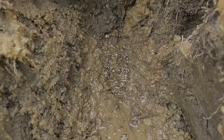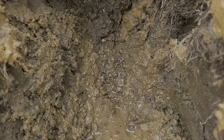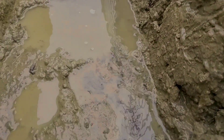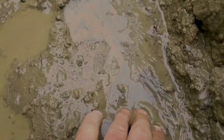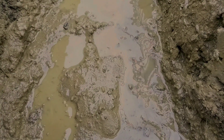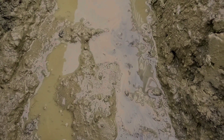Our highways all have French drains under them. They're built up with sand and limestone, and that requires a French drain — and yes, they do burrito-wrap it. Look at all that water coming out. This worked out great; it was right before winter could have its way with this pool deck.